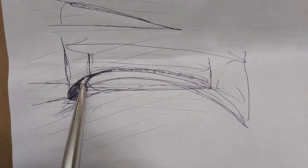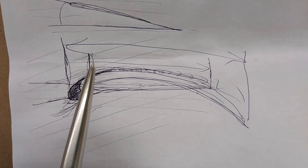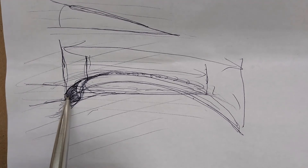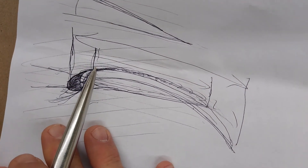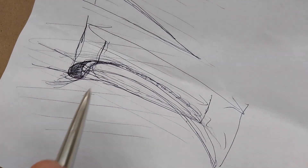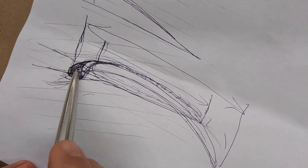That fresh air coming through the slot adds energy to the boundary layer, helping the air remain laminar and stick to the wing longer, delaying stall and allowing the airplane to fly at lower speeds. So because you deploy the leading edge slats, it allows the airplane to fly at higher angles of attack — but to say that leading edge slats increase angle of attack, I think that is incorrect. Just deploying the slats without changing anything else actually decreases your angle of attack.